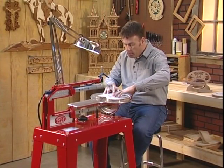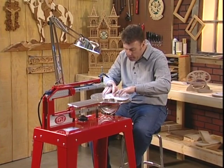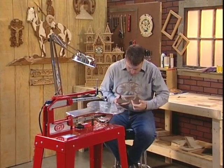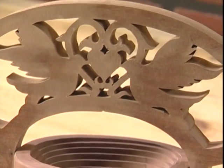We're just following a line — we'll follow that pattern right around all the way until we complete our coil at three degrees. There's our tilted table cut at three degrees that makes our basket go together, along with all the other cuts that we've made.